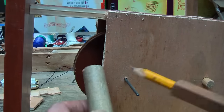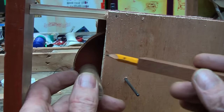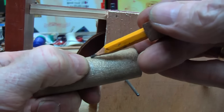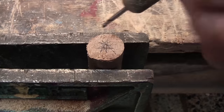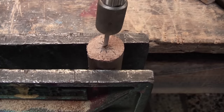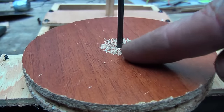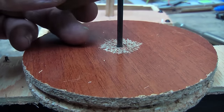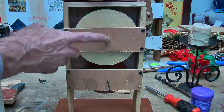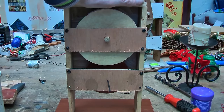That bottom pulley needs a spacer and somewhere for the belt from the top one to run on. So we get a piece of broomstick, put it in there loosely, mark it and cut off a piece that length. Then I am going to drill a hole right through the center — going halfway from this side, then turning it over and coming from the other side so it meets in the middle. I roughened up the plastic coating on that board, put some glue on there and it is going to glue on. Now the big wheel is on and that one spins freely on its nail.